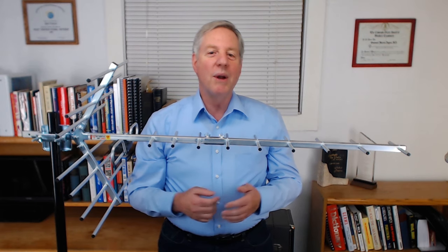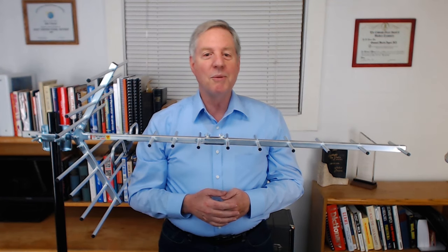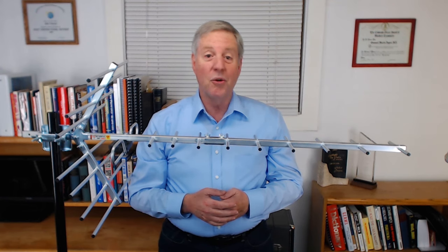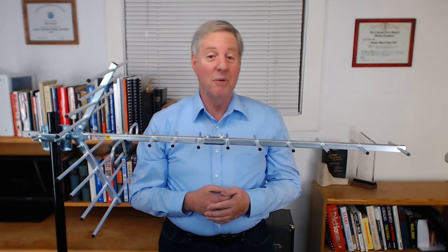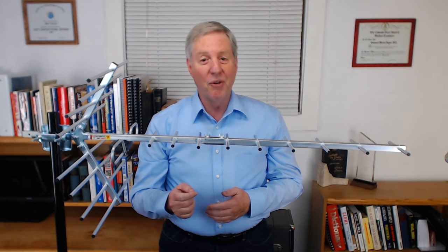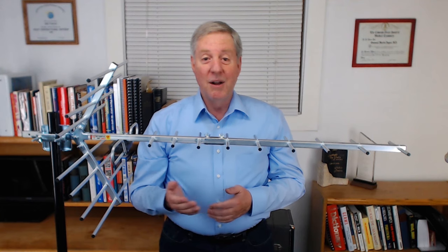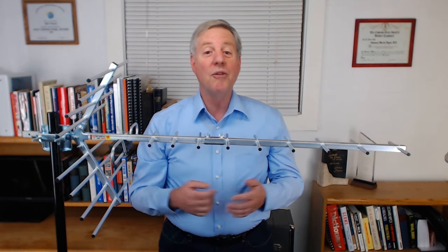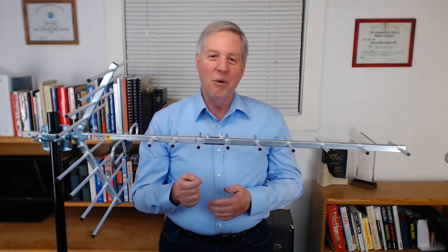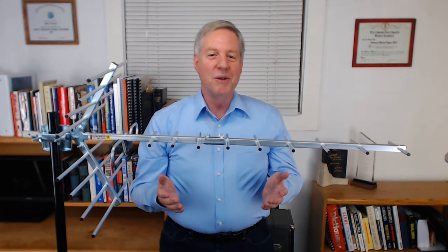However, for some rural area customers with very far-off VHF stations, or those that have difficulty capturing VHF stations due to terrain obstructions, the optional VHF upgradeable kit is an ideal simple add-on upgrade solution for customers that need both deep fringe UHF and VHF performance, and can be added in the future if needed. The optional upgrade kit adds multiple full-sized VHF elements to the XPS 1500, along with a patented low-loss VHF/UHF combiner. So if you're in one of those areas that still relies heavily on VHF, we've got you covered too.